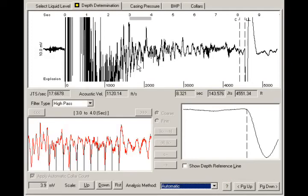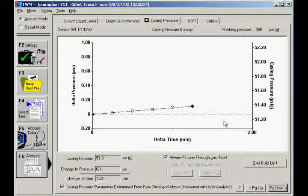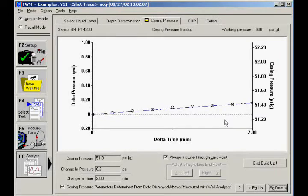Now click on the Casing Pressure tab. At the well, the computer will beep at 15-second intervals to signal that the casing pressure is being recorded and the casing pressure buildup rate is being determined. The casing pressure buildup test is usually recorded for a time period of 2 minutes. It is necessary to observe the casing pressure buildup for a sufficient time to establish a linear pressure trend. TWM creates the buildup line by drawing a line from the origin of the plot to the last point recorded. If the buildup line does not fit through most of the data, wait for more points to be plotted and stop the buildup when the line makes a best fit approximation through all of the points. The annular gas flow rate is calculated from the annular volume and casing pressure buildup rate.